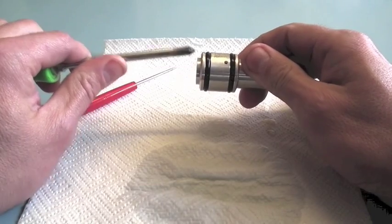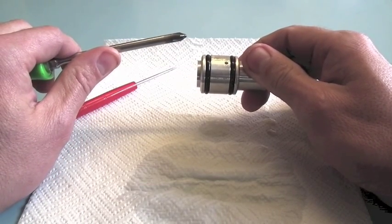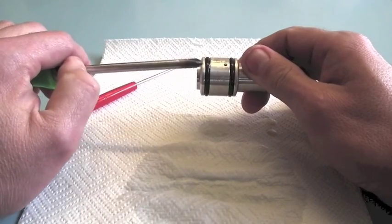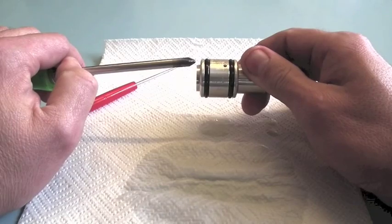This is also why I ask you to put the hole in the reservoir at the top, so that any grease and lubricant stays within the cylinder. It can then act as a lubricant on the seals of the regulator, so that when you come to remove it at a later date it'll come out more easily.